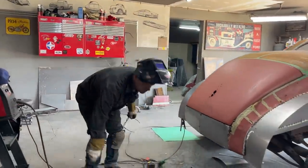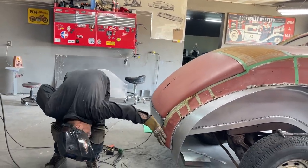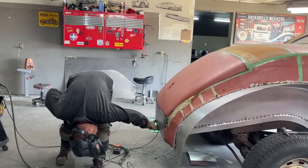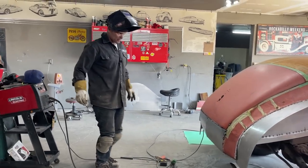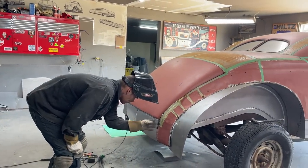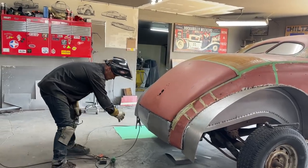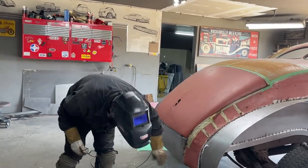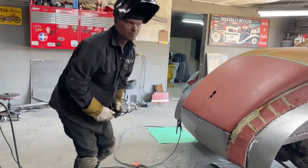I'm going to take a coat hanger. I'm going to weld that back together, cut that up a little bit more, round it off a little bit. I got to get up in here and butt weld that all together along the bottom. It looks a little different because I got it cut different on this side, because that's how that piece comes down. That's the piece they made, and I'm going with it. Once it's all welded on and filled together, you would never know the difference. This one is straight down. This one was curled over a bit. That's okay, because I can see past it.